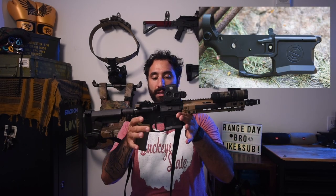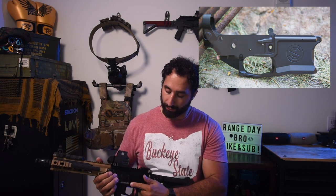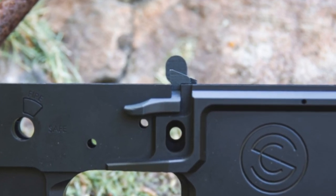One of my favorite parts of the pistol is the SilencerCo ambidextrous billet lower. It's almost completely ambidextrous besides the magazine release — you could install an ambi mag release, and it has a little shelf machined in to protect one. One of my favorite things about this entire build is the ambidextrous bolt release, which is actually one piece with the other side — just a little cut-out in the lower receiver lets it come through to the right-hand side. I can hold it up, lock the bolt to the rear, then on a tactical reload, throw my mag in and drop the bolt forward with my index finger and go right back to work. I've done shooting drills against friends without a lower like this and I smoke them every time, even if I mess up the reload.